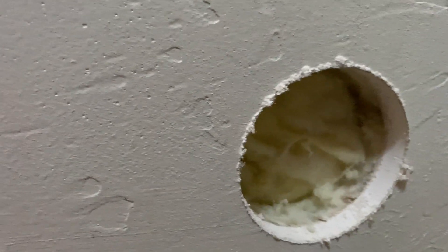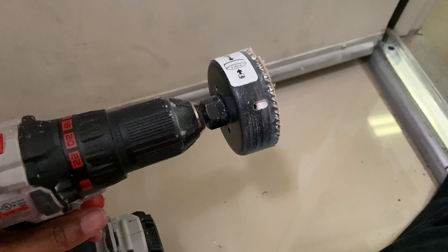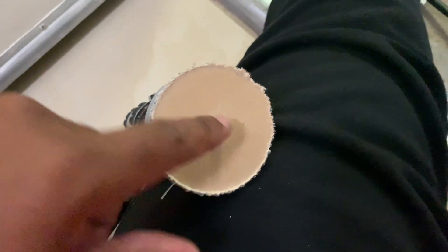The hole is now made — this is the hole here. Looks like we got some insulation on the inside. Now I'm going to drill all the way through because there's a tip on the end of the hole saw, and I want that tip to go through the other side of the wall to make an indentation so we can start drilling from the other side.